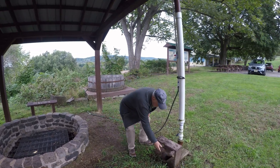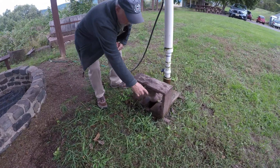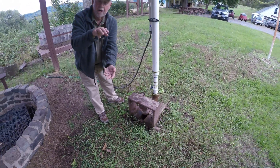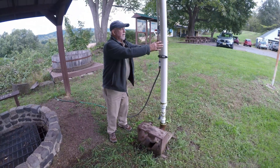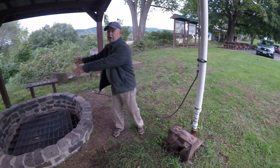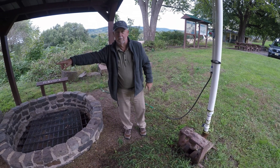This little model — the water is going to come out of the quarter-inch orifice, but down in the actual turbine, that orifice is 3 by 17. This is about a 10-foot head of water; the real system was a 47-foot head of water, 5 feet across. That column of water had tremendous pressure when it came out of the turbine.